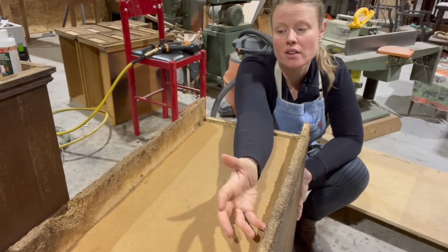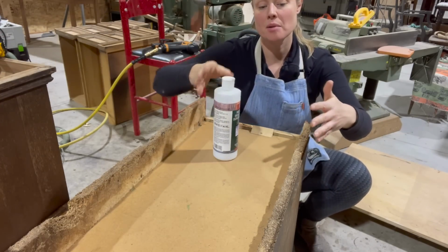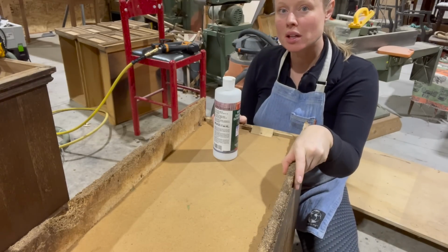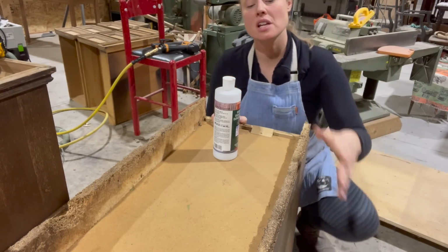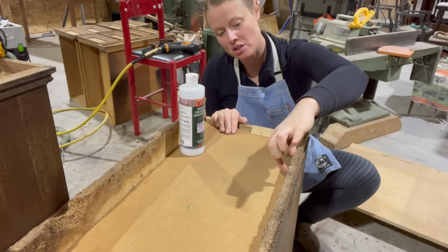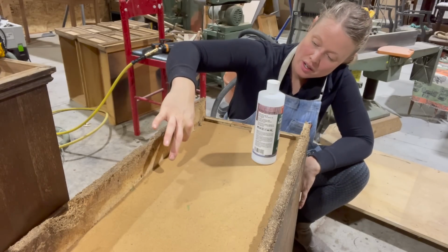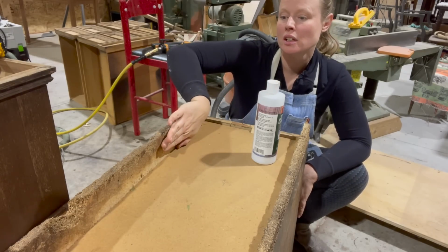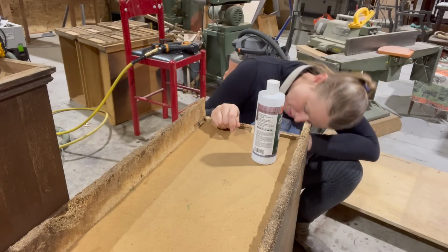And even at that point, I'm gonna have to wood harden all of the stuff because I'm only gonna be able to go down pretty much as far as this is right now. Because I need to leave a little bit of this to attach, because it's this attachment for the entire side. So I can't take all of this down. It looks like it stops being really bad just a little ways down here. And this side's not as bad, so I should find okay wood pretty much down here. And then I'm gonna do a solid wood piece to support basically everything, which is gonna be the new supports for everything.